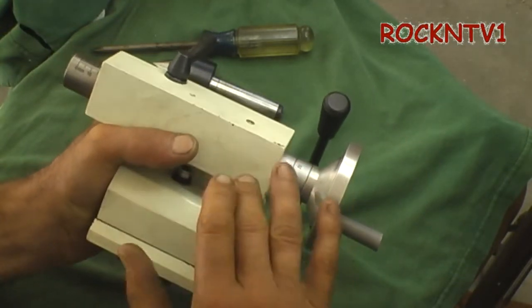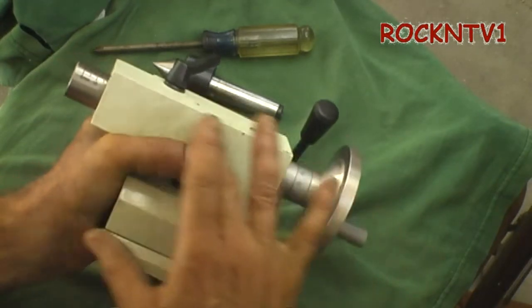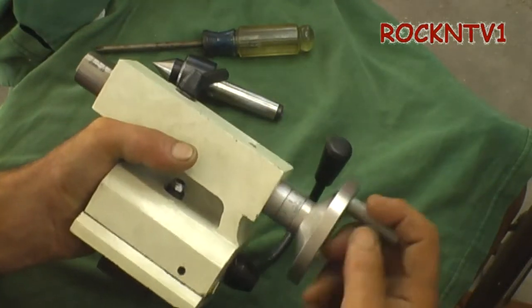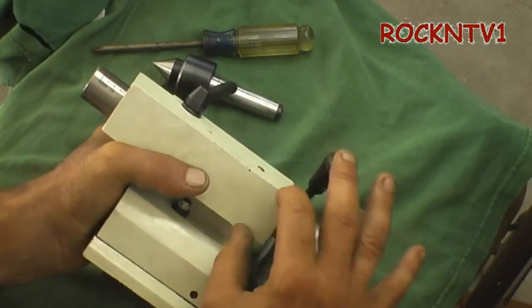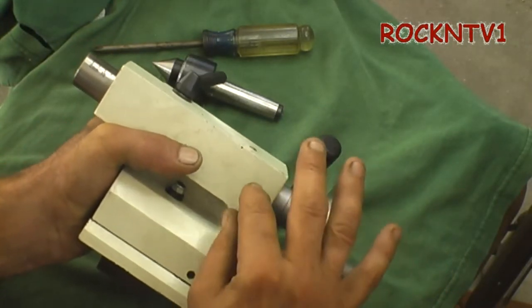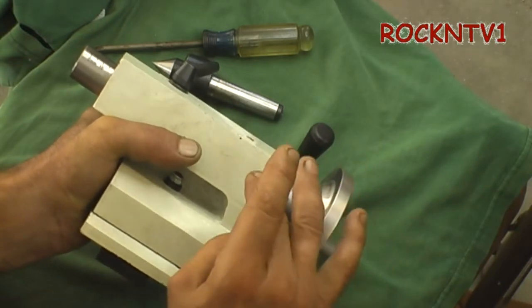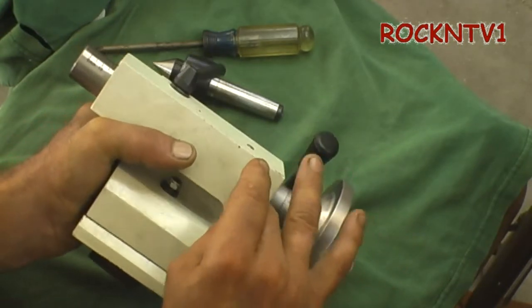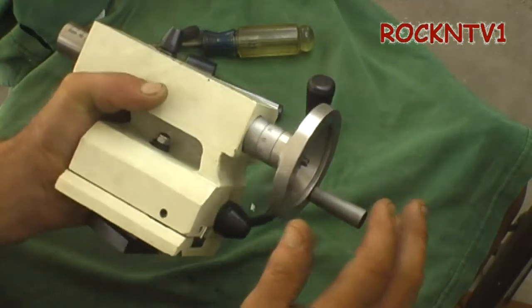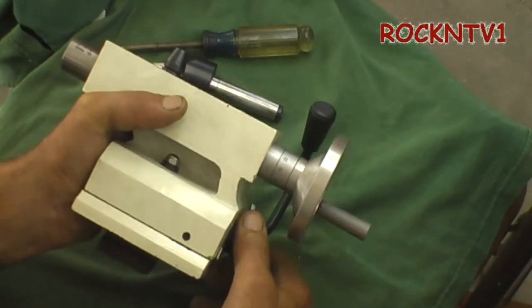The only thing I am having a little bit of a problem with is the threaded nut that operates the quill back here. If you put too much pressure on it from a big drill, it wants to drive itself out of the housing. So the interference fit was not quite right on this. But I'll be drilling on both sides anyway and putting a grub screw in there to positively locate that for the future, and I'll be able to apply as much pressure as I want from the tail stock — within reason.